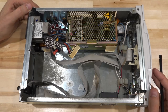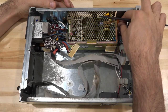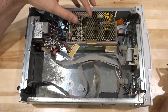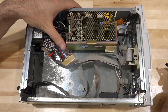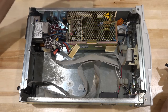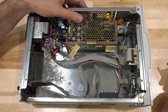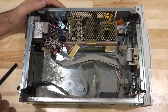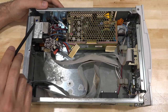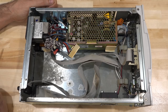Other than that, it's pretty straightforward on this side. I disconnected the connectors and the AC line coming in, so the power supply is really modular and on its own. It's from the Integrated Power Division — I've seen this brand before in many Keysight and HP instruments. HP typically doesn't make their own power supplies. The AC line coming in has a very nice filter on it — a pretty good quality one with a fuse built in, giving a fairly clean AC line going in.